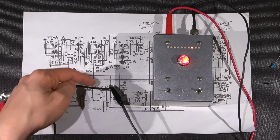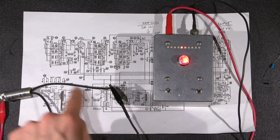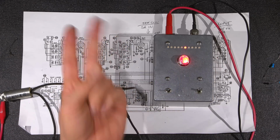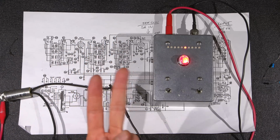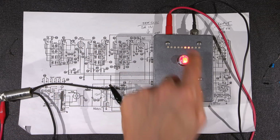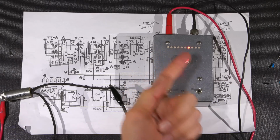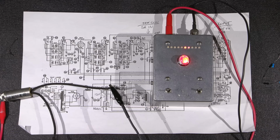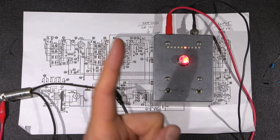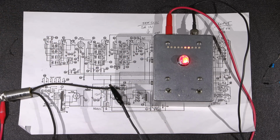So this would have been the side that caused the issues. Now, depending on what side you plug this into the wall, okay, because remember, this is putting low voltage across this, and this is seeing this issue right now. The line cord that's on this thing isn't polarized, so you can plug it in this way or plug it in this way. So there's a really good chance that you would have put the hot side on this, and that would have been connected to the chassis. And as you can see inside, it's intermittent. It's basically, you could say, sparking inside right now, or sizzling inside there right now. And I can almost guarantee if this was plugged in, the next time this was plugged in, that would become a dead short. So it would have attached the line cord to the chassis.